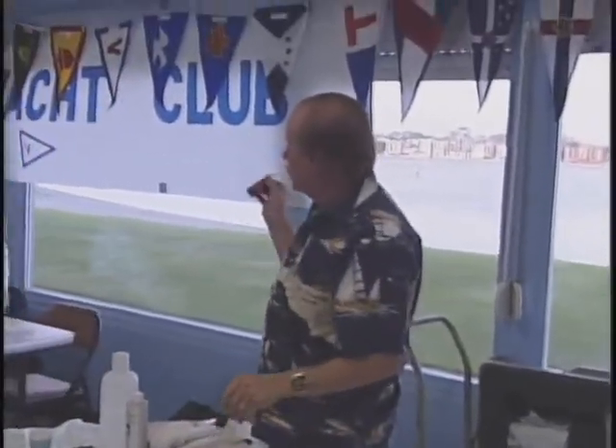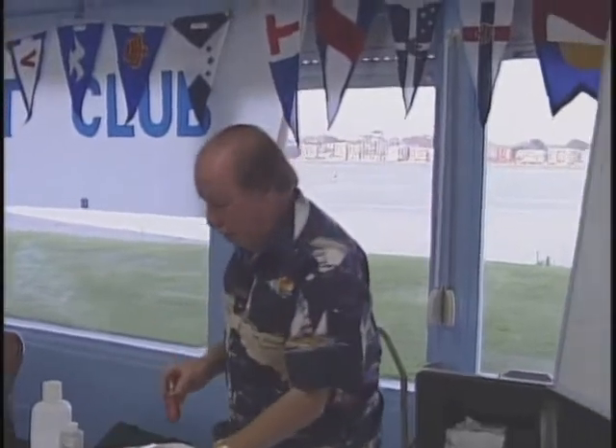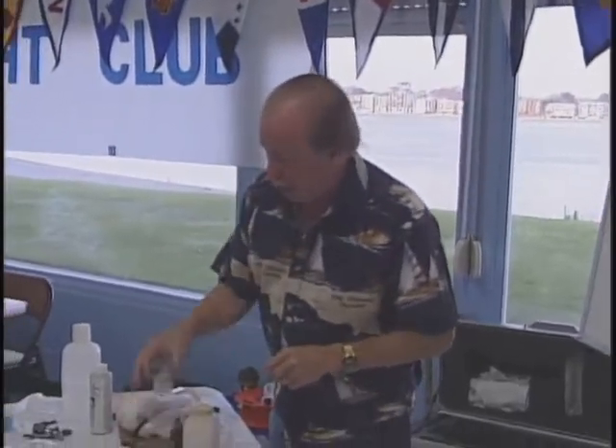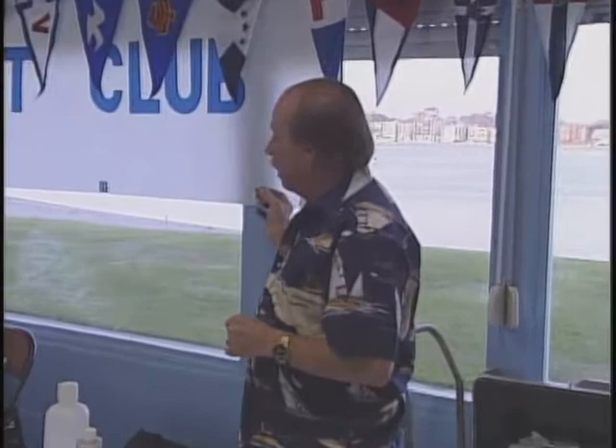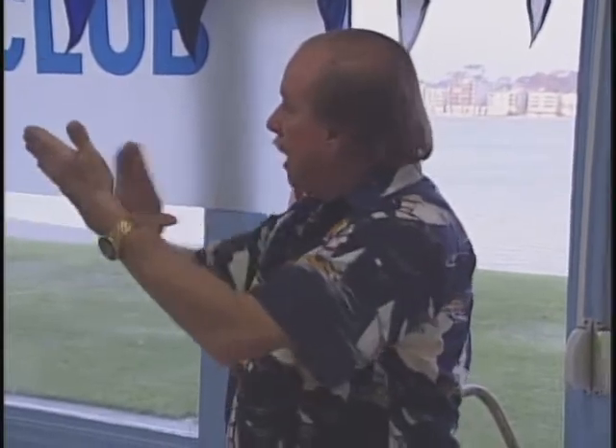There are different colors — some are opaque and some are translucent. On our boats we would want to use an opaque, probably white or blue if you've got a blue boat — light blue, and we've got some M boats that are dark blue. What you do is put your thickening agent into your white gel coat first because the white gel coat is very opaque. Start adding your color to it a little bit at a time until you get it to match the hull.